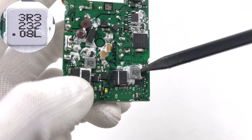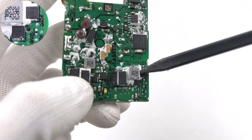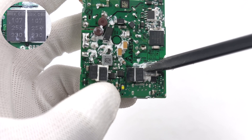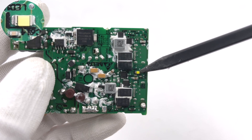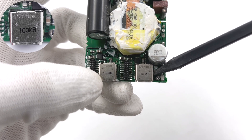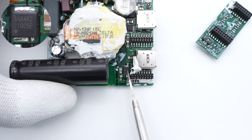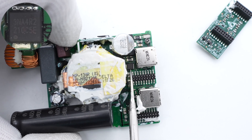The output circuit for the other USB-C port uses the same alloy inductor, buck MOSFETs, and SMD solid capacitors. This is the indicator light. There are two USB-C connectors engraved with LOTES. The two VBUS MOSFETs of both buck circuits are also from Advanced Power, 30V, 4.2mΩ.